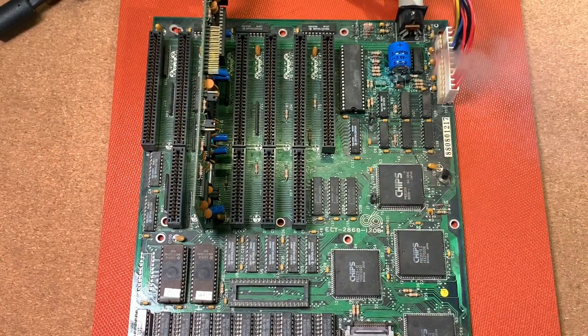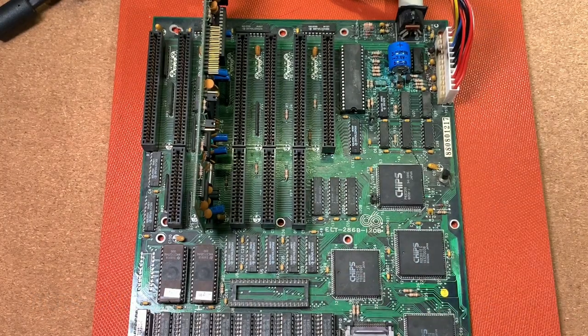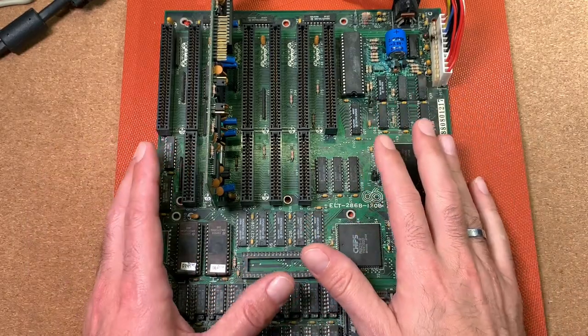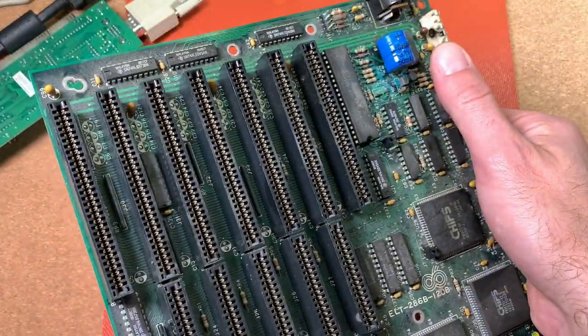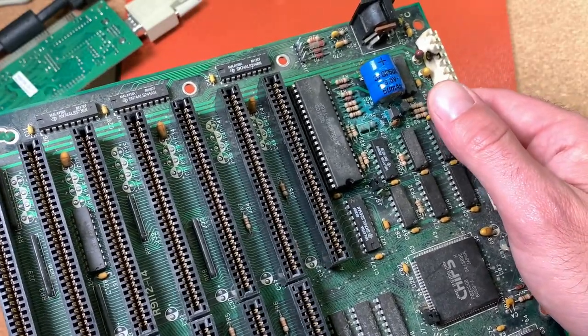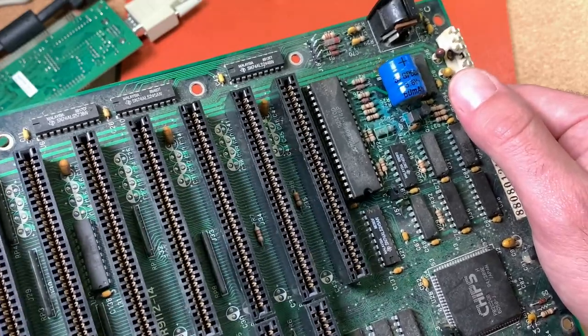Let's switch it on. These are the unexpected things which can happen — sorry for cursing, but the shock was putting me back to my native Austrian dialect. These small bastards, these tantalum electrolytic capacitors, they like to explode sometimes when they are getting old. Best case is when they are just shorted and the power supply goes into over-current protection and switches off, but in this case it was just very low ohmic, taking all the current until it explodes.